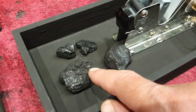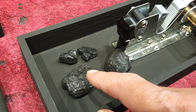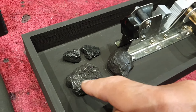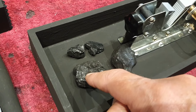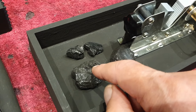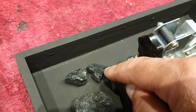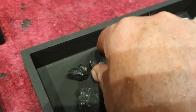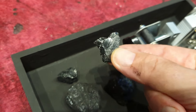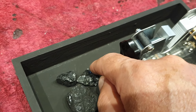For this purpose I use two types of coal, which I also use for my big amphora steamboat — the six meter long steamboat. One is Welsh coal or Polish coal; the quality is really good, it contains a certain percentage of gas and initiates a fire quite easily. The other is anthracite coal, which is in principle 100% carbon, free of gas, and very hard.